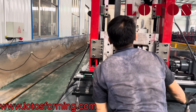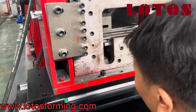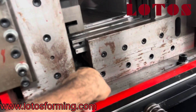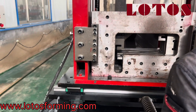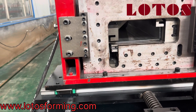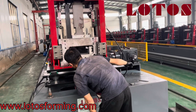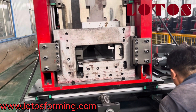This is the multi-cutting die. It has a screw connected to this part and we can put it up or put it down just for the cutting die. Two sets of CZU are already finished to install. Now we are fixing and changing this cutting die from C shape to Z shape.